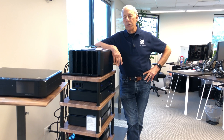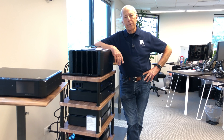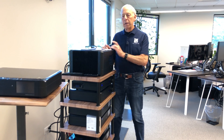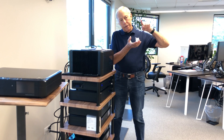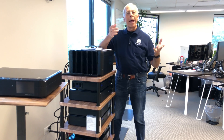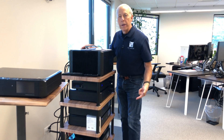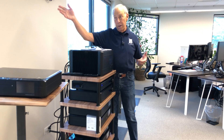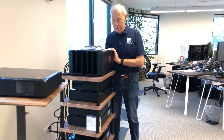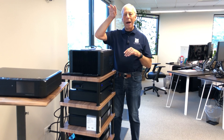Yes, you can use a stereo amplifier to create a mono amplifier. How does that work? It's called a bridged amplifier. Normally a power amplifier is an amplification stage that has a single output, which on a power amp is usually the red terminal — the red speaker terminal on the back. Black is typically ground, and ground on this amplifier is the same as ground going into your plug. It literally goes to ground — it could get there on the third prong of your plug — but ground is ground the world around. So one side is ground, and the other side is the output of your power amplifier, which is the red terminal.